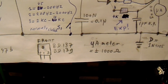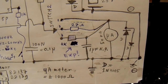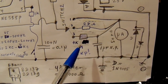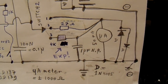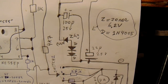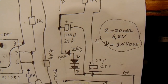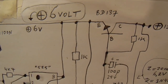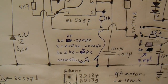Here are the pin connections for the transistors. The meter has a DC resistance of approximately 1000 ohms — it could be another meter with 1600 ohms or so; it doesn't matter much, but you have to adapt the resistor values experimentally: 27 ohms and 4k shown here. The meter is safeguarded by two silicon diodes anti-parallel and a one microfarad non-polar capacitor. The power supply uses one transistor; the Zener is 6.2 volts, combined with two normal silicon diodes in series, giving exactly 6 volts at the emitter.